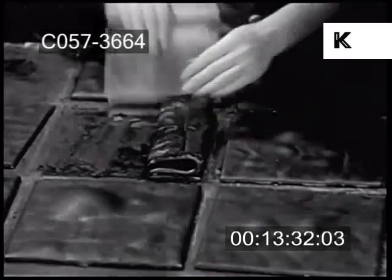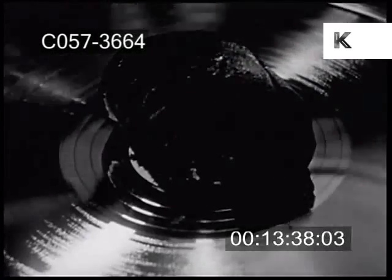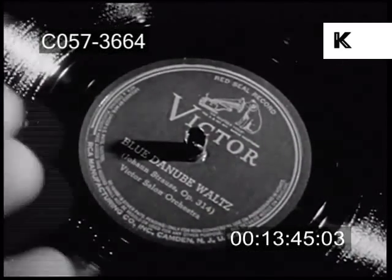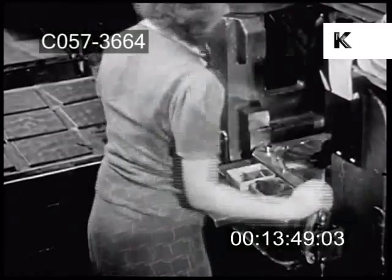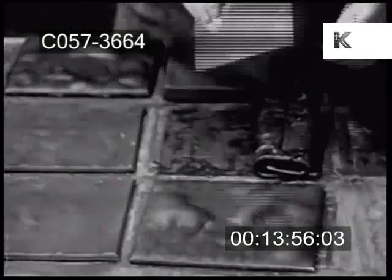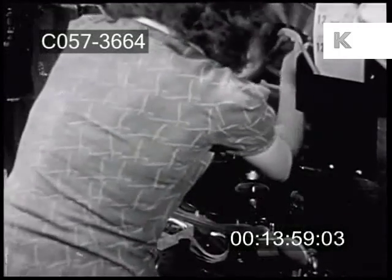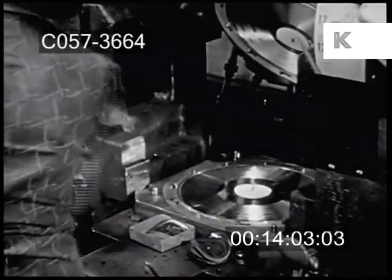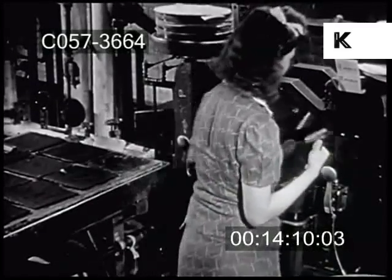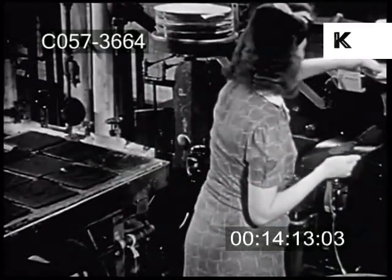The biscuits, cooled for easy handling, come off the belt in neat little piles. Before they are used for actual pressing, they must be heated again on steam tables. Then I saw a record pressed. First, steam is shot through the machine, then cold water runs through to cool the record. Two different stampers are used in the machine at the same time to press the two sides of the record simultaneously. The labels are put in before the biscuit and actually pressed into the record, not just pasted on.